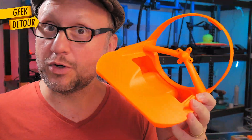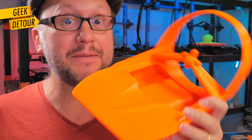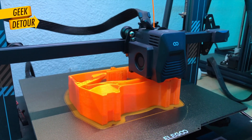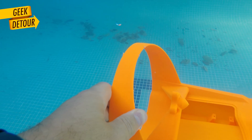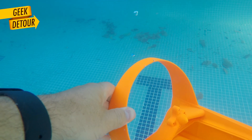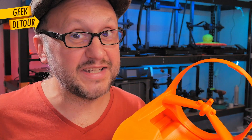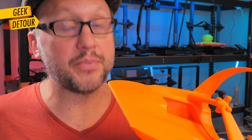To be sure the prints were watertight, I began printing it in PETG on a Neptune 3 Plus — super slow, to fuse the layers very well. Did it work? No. I still had to seal it with a spray varnish, and even then I still found imperfections.